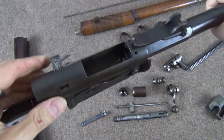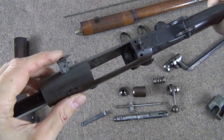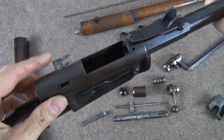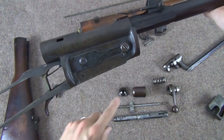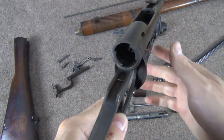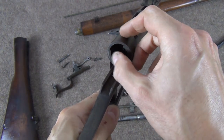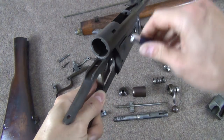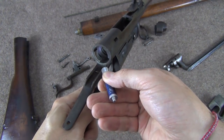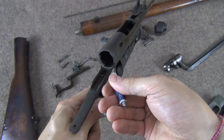The main body of the receiver has two main parts: the upper tubular bit which houses the bolt, with an opening for the lifter, and a little wedge — a key — which is very cleverly captive because soldiers would lose it otherwise. This key has two jobs: firstly it acts as a bolt stop when opening the bolt, and it also is part of the safety because it only allows the bolt to close when it's fully forward. And at the back we have the two locking surfaces — despite what it looks like, they are integrally machined into the tubular section. They are just straight rectangles — you can see there are no slope or camming surfaces on the front of the locking surfaces, unlike for example the Mas 36, so it's just straight up and down when you lock it.